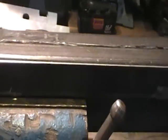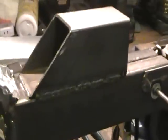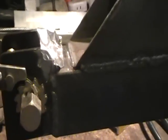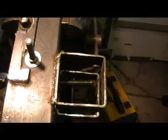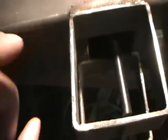Okay, front sight attached. Put on this rail here to reinforce it, also to space out the aluminum guide that goes on top. We've got the rear sight mount put on, and then our ratcheting device with a new handle. And now we're gonna work on the trigger guard. Okay, welded on the trigger guards. Now you notice that there's a gap in between the two here, because we're gonna eventually put a solenoid that will electronically fire the weapon, or you can manually fire it by grabbing the trigger.